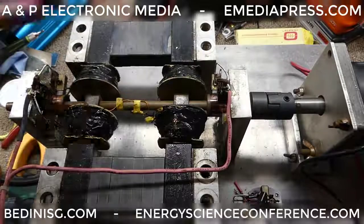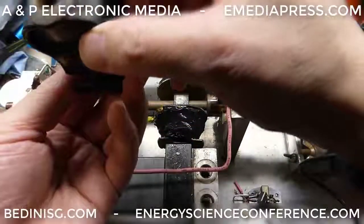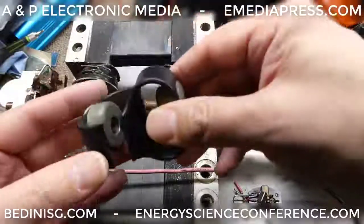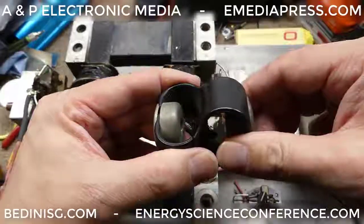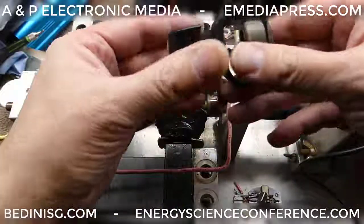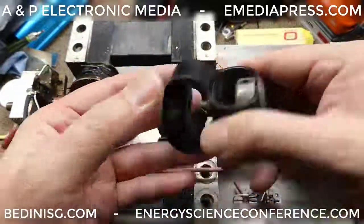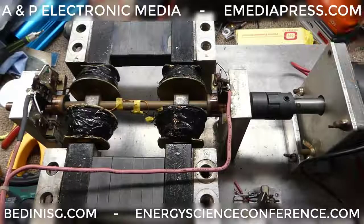The original coupler here is a Cushman company coupler — they don't exist anymore, but you can find these. It was used in case the drive shaft or the prime mover and the generator are not perfectly in alignment, giving a little bit of free play. This one is old and hardened, so I've got a Lovejoy coupler and have it rigged up so that we do have pretty good alignment.